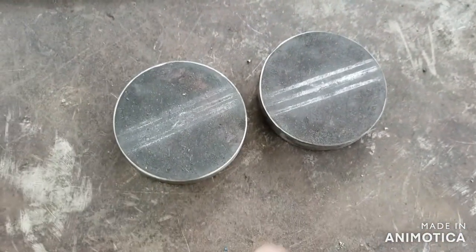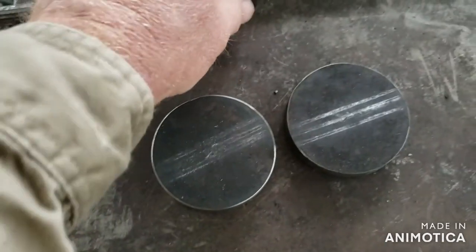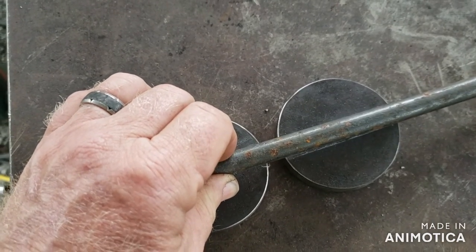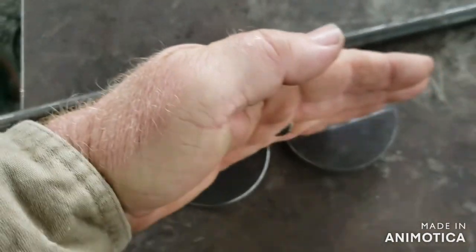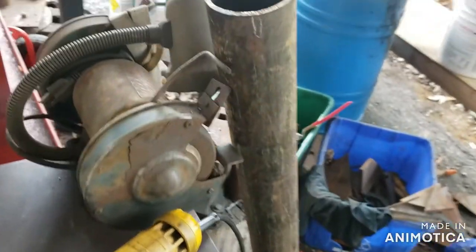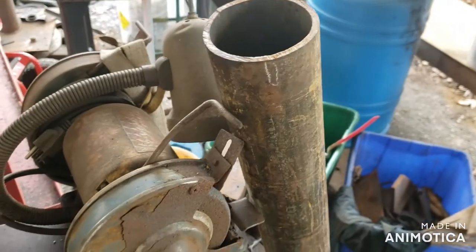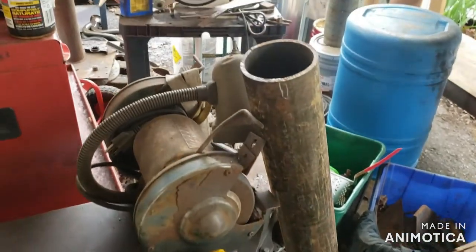And the plans are to cut a 3/8 inch section right out of the center of them, and then place that on either side of the 3/8 rod and weld it on, and then take the other piece, and go 90 degrees to it and stack it this way. So you got one disc that's running this way and one disc that's running this way. They'll be on the 3/8 rod, which will notch into here and leave a handle outside of the forge box that we'll be able to then turn to break clinkers and get it all free.